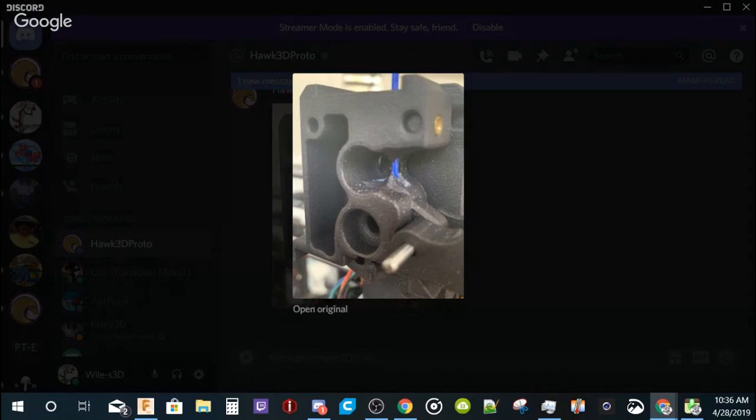But that filament could just be softer filament that it's flaking off like that, and it just crammed that hole full of flakes, and then you're jamming that filament through there too. That's probably why it did it, the way how it looked. Yeah. Or not just ground up like that because it got stuck. I'm going to give this feedback to the company for sure. Oh, yeah, big time. I'm also noticing, if you look how deep the teeth cuts are in the filament, it makes me think the filament is actually bigger than what they suggested it is. Yeah, that's why I told them to measure the filament. Because that has to be off-sized. Yeah.